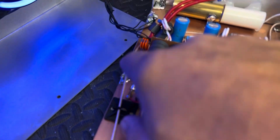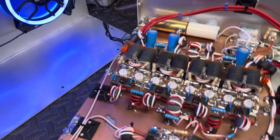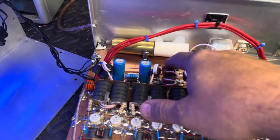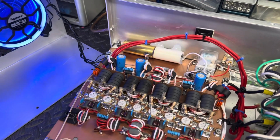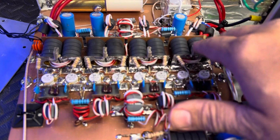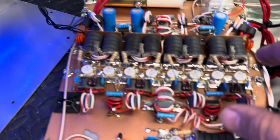I redid the side over here, and I put new screws in it and fixed the old holes, fixed that side. Then I redid the coax. It was all ripped loose and jerked off. That resistor was blown, that was up and pulled loose, so I changed them resistors. Then I went through and got to looking, and all the metal clads had been knocked off, they've been hit, so I changed them. I replaced the four metal clads here. I was able to save this metal clad, and these two pills are good. Then I put all eight new transistors in it.